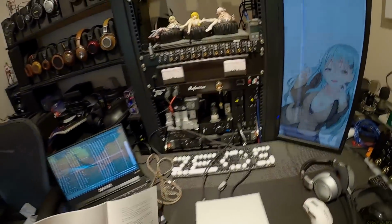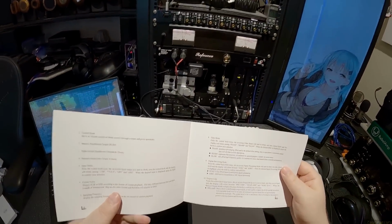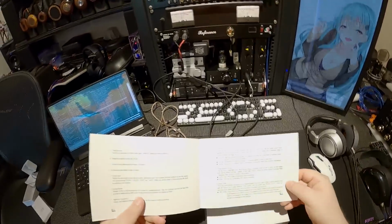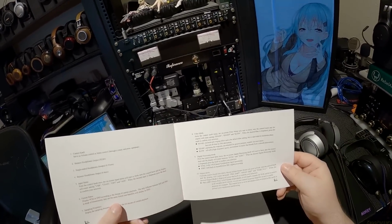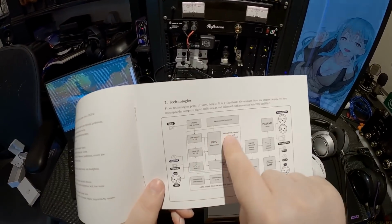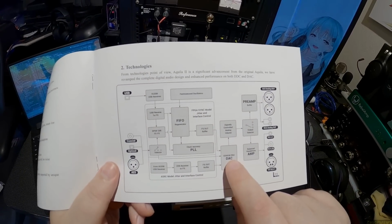And then the only descriptions I have, and this is all I needed to know, were: sync is fully FPGA-based synchronous digital processing, like the iON X8 Magic DAC, or ASRC, which uses the ESS built-in asynchronous SRC digital processing. So if we go back to this, basically all this whole monstrous box here, you don't want to use that. You go to async and it goes right to the DAC, which is an ES9038 Pro.